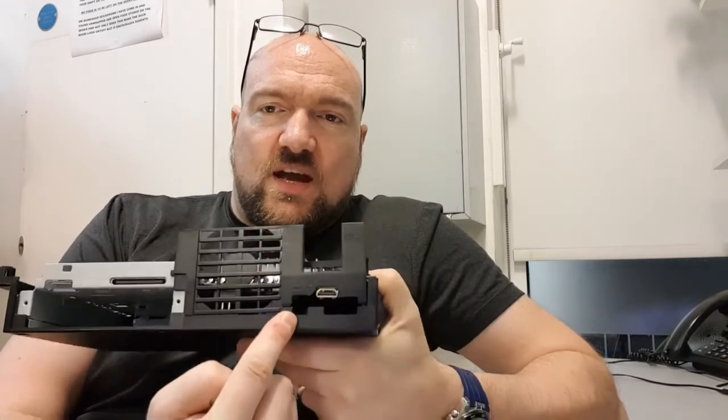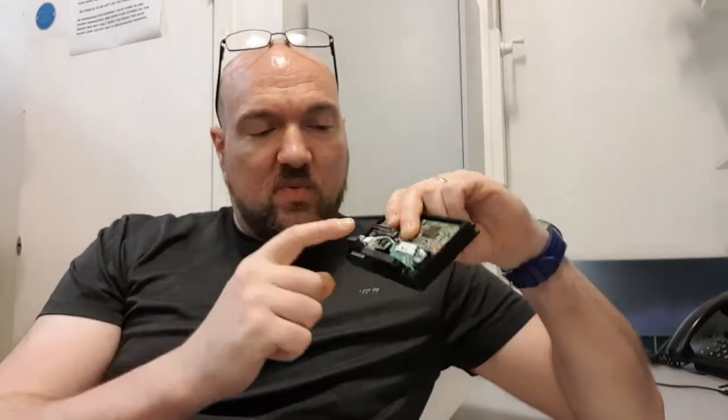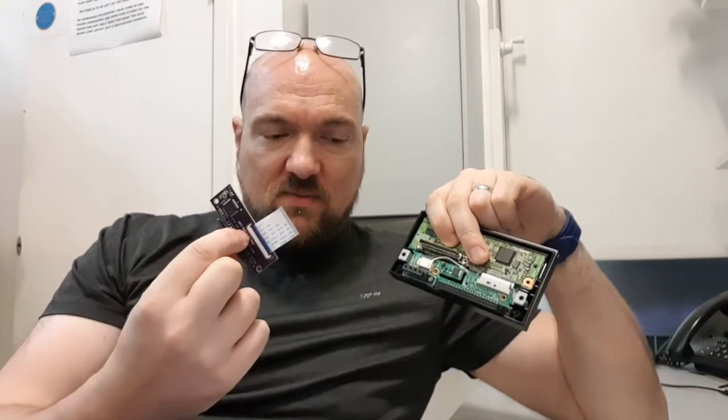Right now you can see the HDMI slot is mounted — I've cut the hole for the back, it's not pretty but I'm going to fill it, sand it, and it'll look flush when done because it's getting painted. The HDMI mod is working really well — I really like it. It's cheap, I get that you're going digital to analog then back to digital, but it was £3.50 and took 20 minutes. Today's job is to figure out how I took this network adapter apart, sort out all the screws, and swap over the boards.